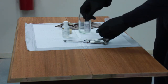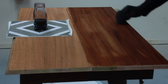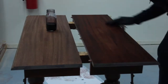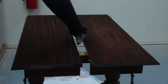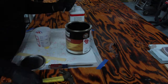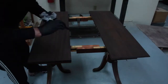My daughter's kitchen is gray with white, and it's not that she doesn't like the natural look of mahogany — she just thought it was a little too bright. So she wanted me to turn it gray, and I told her there's no way I'm gonna be able to turn mahogany gray. It's just one of those woods that doesn't like certain things. If you look on the side, you can see the pine ended up turning gray but the mahogany just got dark.